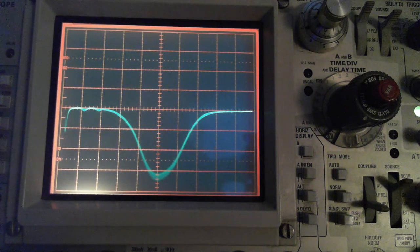Oh, look at that. Now, see, it's kind of widening out down there. Okay, like that. Bottom of the second transformer. Now, if the radio goes nuts, I won't hear it because I don't have the speaker volume turned up. That's lovely. Okay, and the top of the tough one, the tough top. I'm doing all this on restricted voltage here. Let me put the proper voltage on.